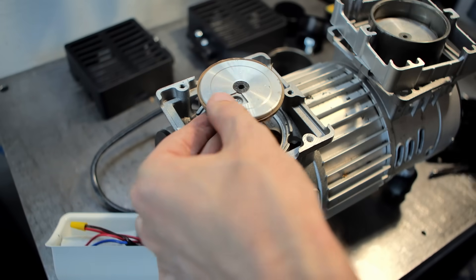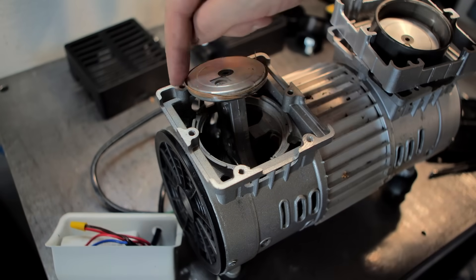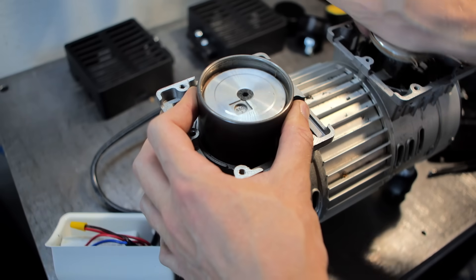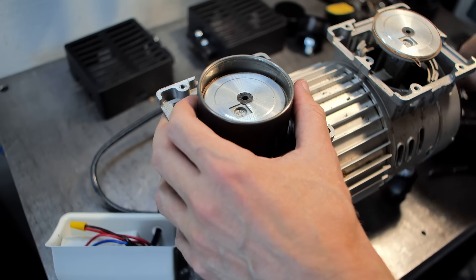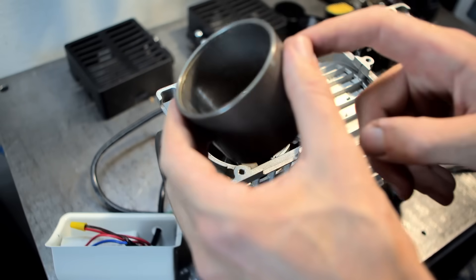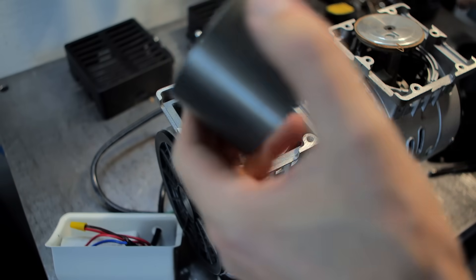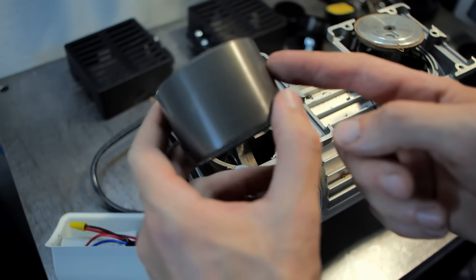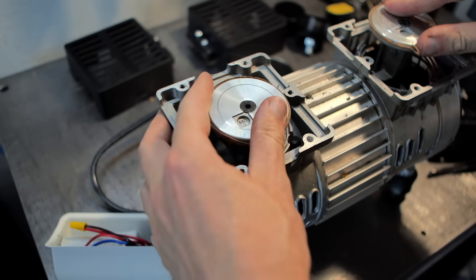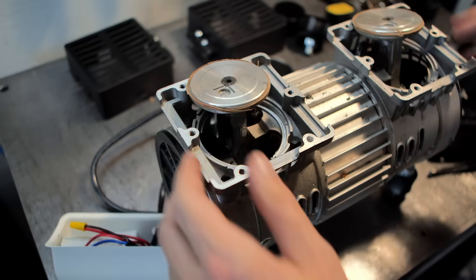On these compressors, since the piston is so narrow and has only one elastic seal around it, it just tilts back and forth in the bore — which is quite fascinating. Remember, this compressor is 10 years old and ran completely without any external lubrication. This is the cylinder, and there is literally no sign of wear. I think it's aluminium — hard anodized or hard coated. Super primitive but kind of a beautiful design in its simplicity and ruggedness.